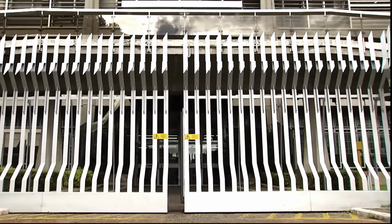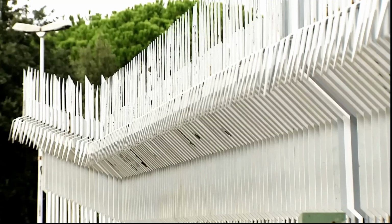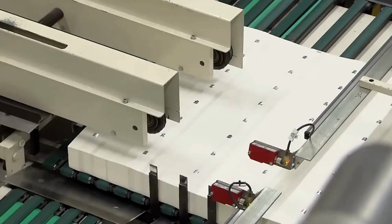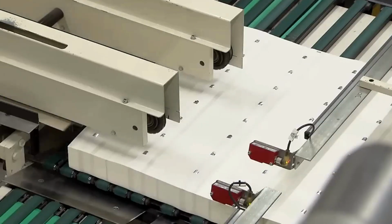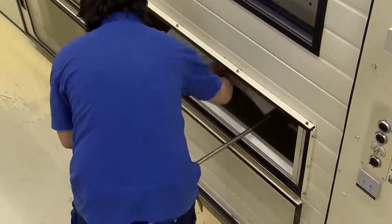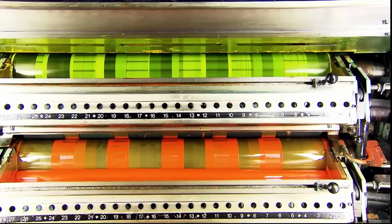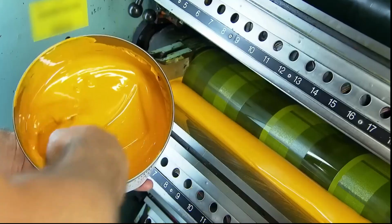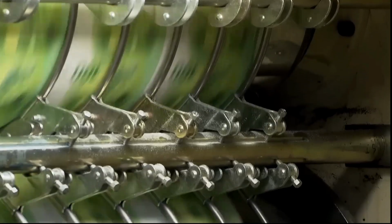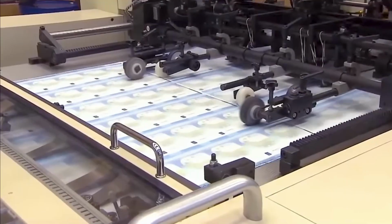Now, we enter the fortress of banknote production, a place shrouded in secrecy and precision. Every step here is designed to deter counterfeiting and maintain the integrity of the euro. The first stage of printing involves offset printing, which applies the base colors and some initial security features to both sides of the banknote. This includes the main image, which represents the European architectural styles of Baroque and Rococo for the 100 euro note, as well as the intricate background patterns.